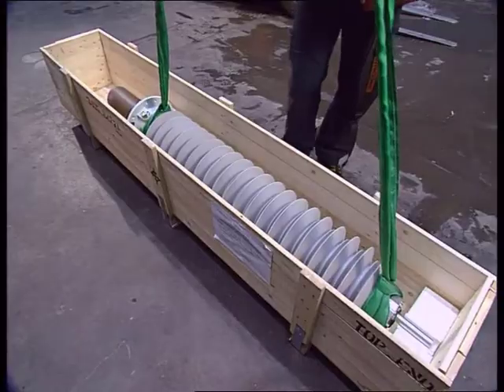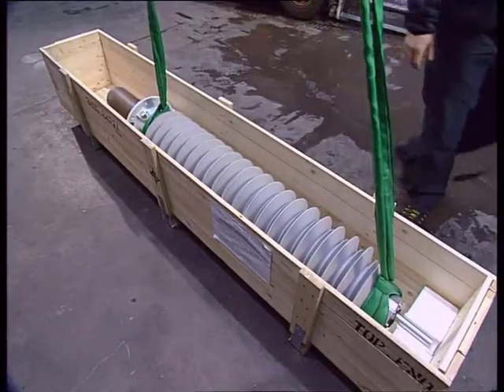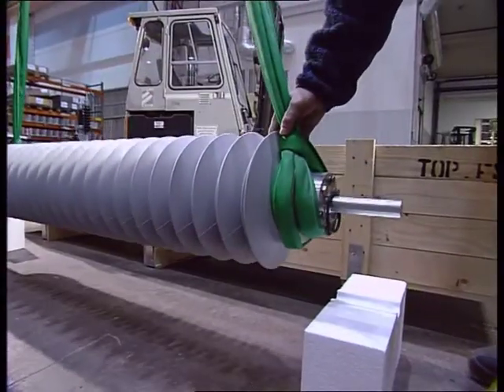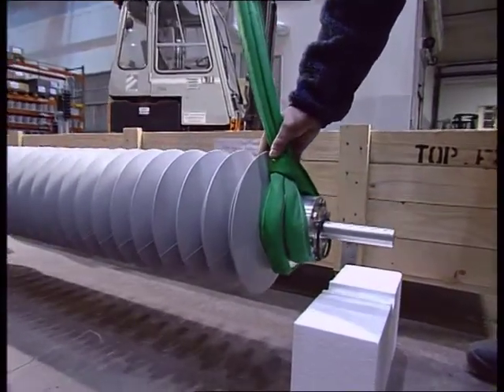Place GSA bushings and other types with silicone insulators on stands in the same way as for porcelain bushings. The bushing should never rest on the insulator.